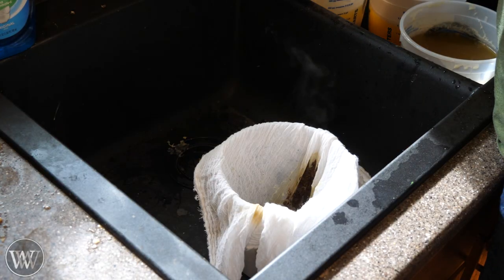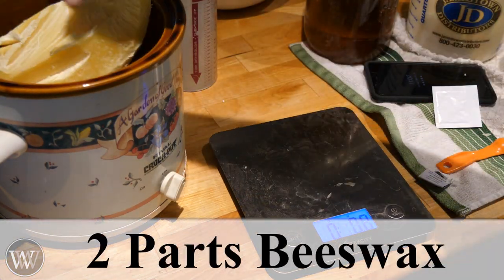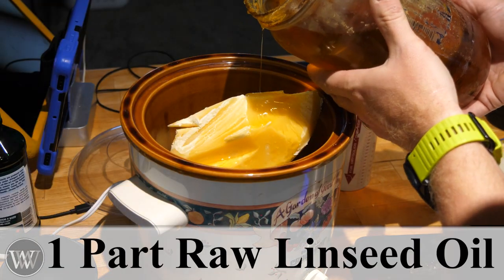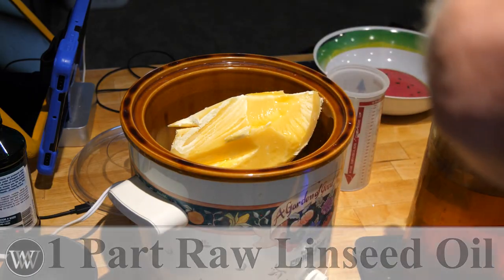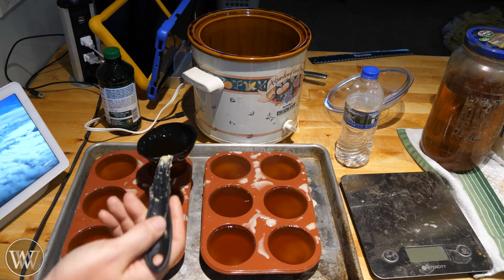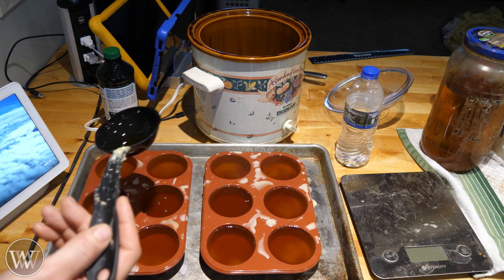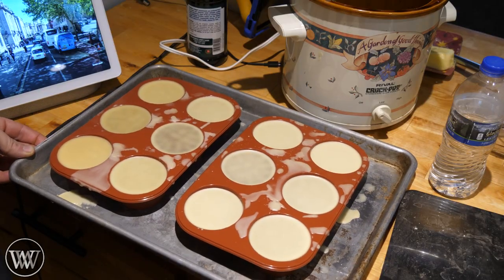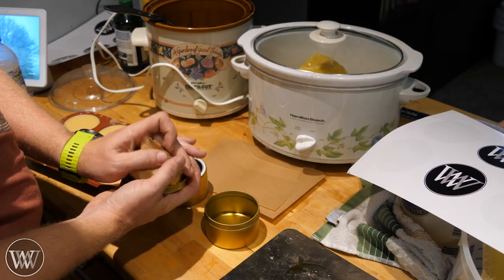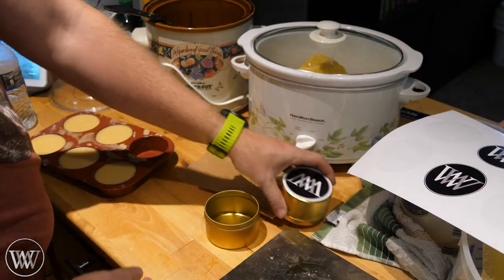I'll usually end up with four or five buckets worth of wax and water. The next day we've got chunks of wax. I put them in a crock pot and start melting them down. For the hard wax, it's two parts wax to one part raw linseed oil. I have a friend who has a cold press and will press out the raw linseed oil for me. I don't use boiled linseed oil — I want it to stay waxier and oily longer, so I use raw linseed oil. I pour it into trays to get the pucks and let them cool and harden, then wrap them in wax paper and put them in a container with the lid down.